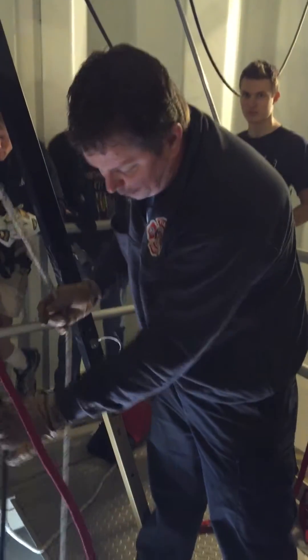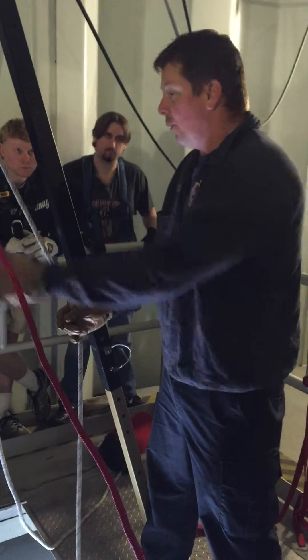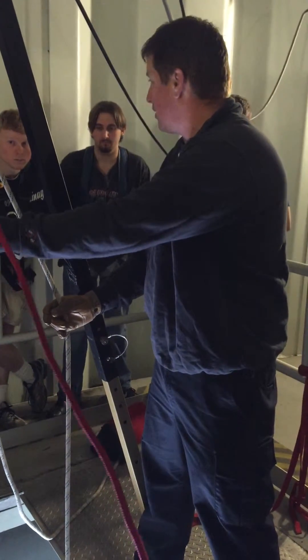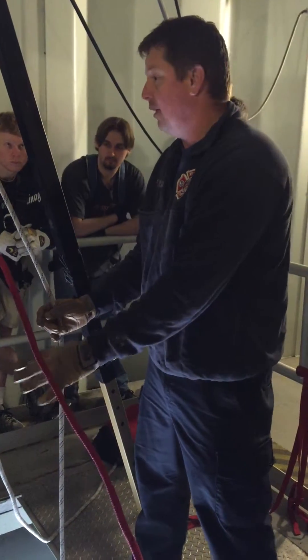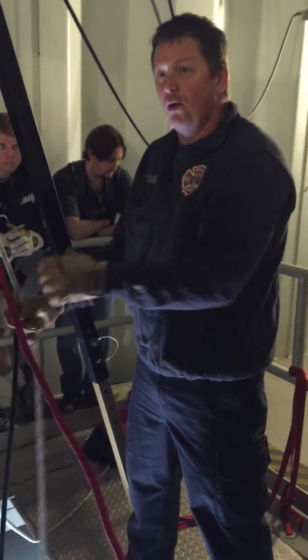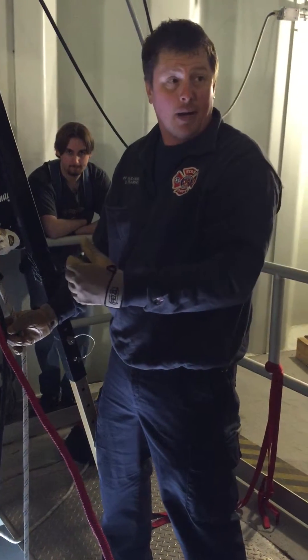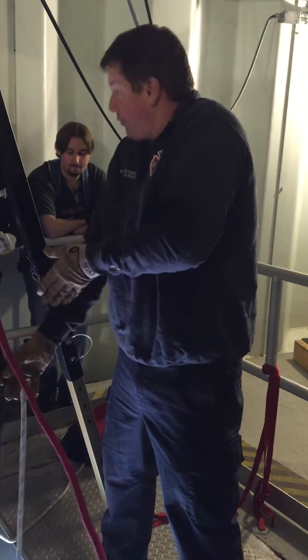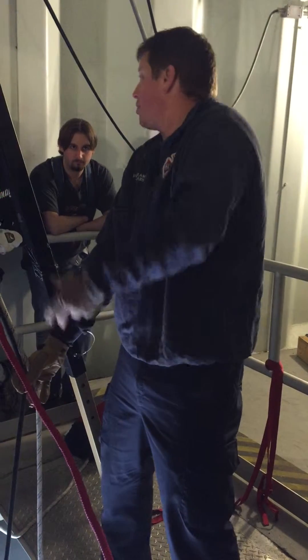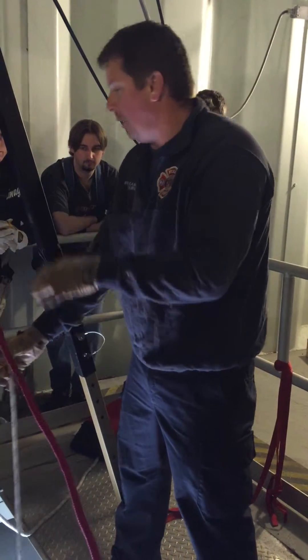Like I said, the entrant — he's on our black rope right now. Even if he was a contractor or somebody who went in, we don't have this mechanical advantage. It's there for everybody that's down in there. We can put it to the side, but right now we want to pull him up. Remember, who's the first one that comes up? Probably the last one that went down, correct? Because we don't know if they're in a tunnel. We don't want to pull the first guy over the top. It's not always the case, but probably.